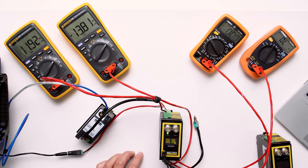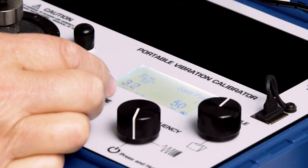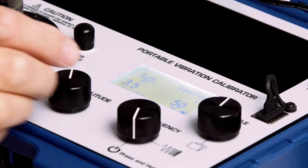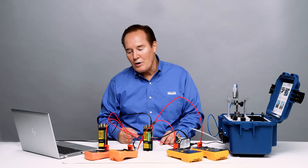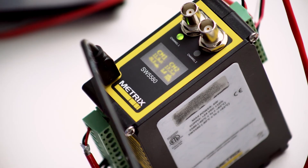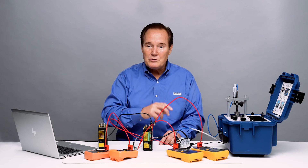You can see that the alert relay closed — the electrical path is complete because the relay is now shut. We're going to increase the vibration now up to 3.5 mils and the danger alarm will come in. You can see the relay tripped — we have almost a short, about 0.1 ohms, which is what we should see. You can see the relay has changed state with the flashing LED. Now we're going to decrease the vibration level to 2.5 mils peak to peak.